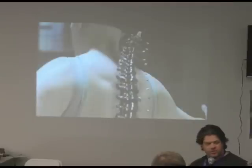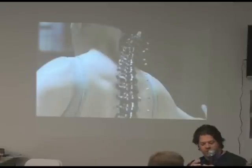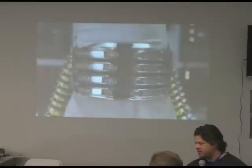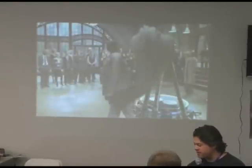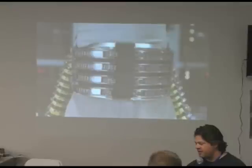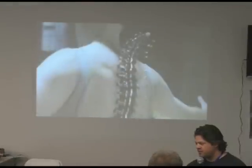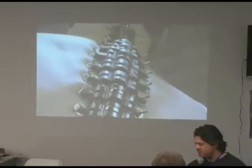He would walk into it and the servos controlled the ribcage shutting. The stamps made all the little ribs — these chains at the end of the ribs — latch into each other, then servos would move in and the chain would get pulled and cinch down on the stomach. This whole thing was servo and stamp-driven, and I think I had a total of three or four stamps running this one. Fully functional.